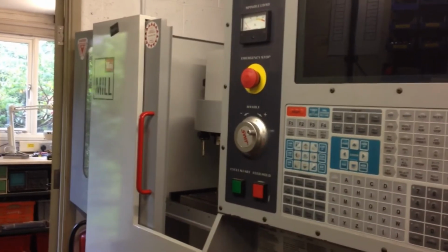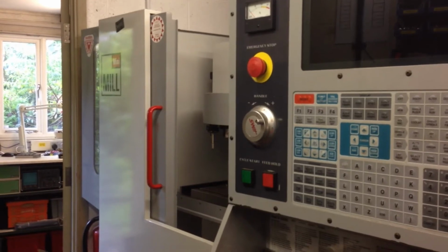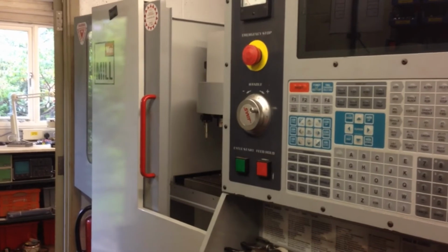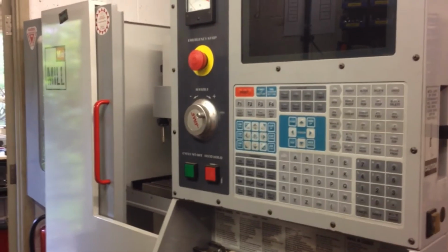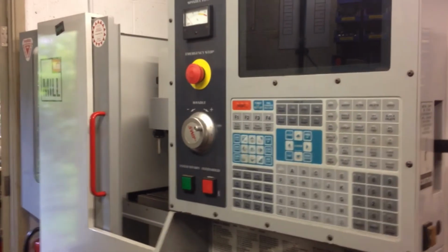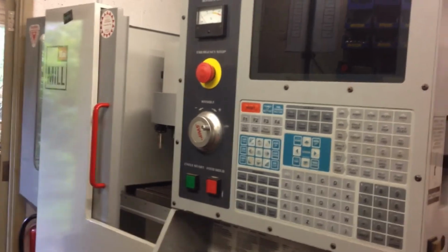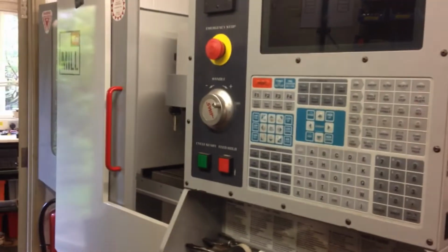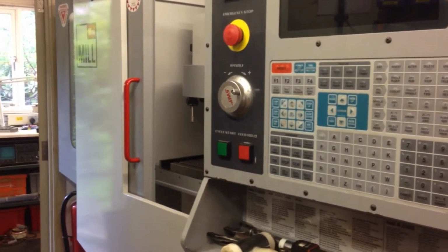She's an old girl, she's 2003, and yes, it has a tool table, but it will record how many hours each tool's done, so you can record the wear. But obviously it's not as fantastic as the newfangled controllers. So basically the only information that's in that controller is what you tell it. You can obviously do the automatic height setting for each tool.